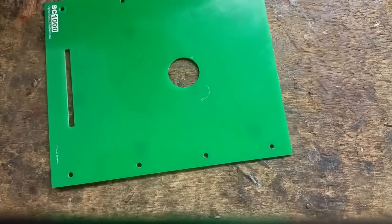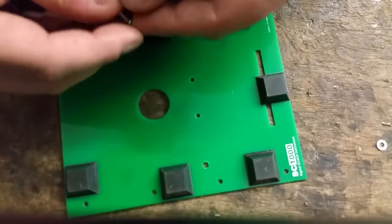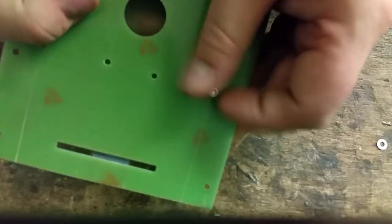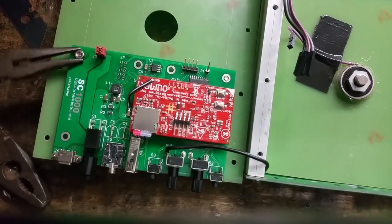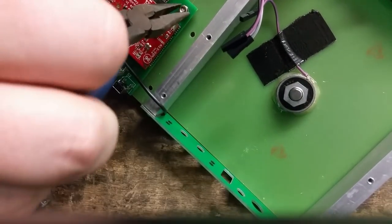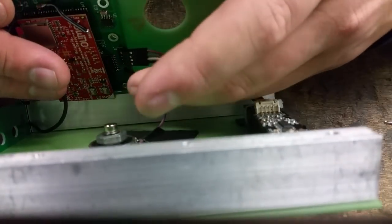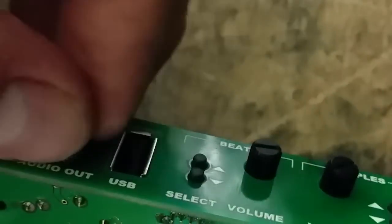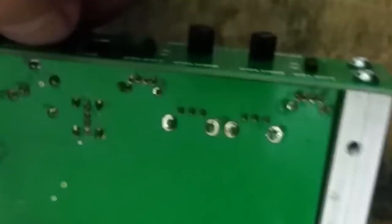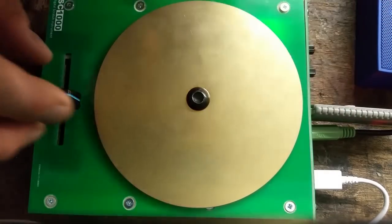Then it's just the bottom plate to do. I'm just going to use another top plate since I have a few lying around. I had to drill a couple of extra holes to line up with the holes in the main PCB, through which I'm putting M3 bolts and nuts on the other side to act as small standoffs. Then we just need to install the main PCB on it and attach it with two more nuts. All that's now left is to connect the bearing and InnoFader to J4 and J1 respectively, and the bottom plate can be attached to the rest of the enclosure, much like the top plate was. Remember to attach the nuts to the audio out socket, and everything's done.